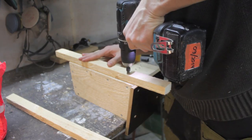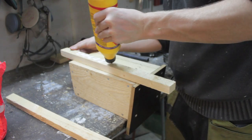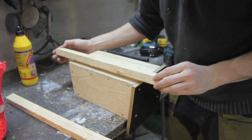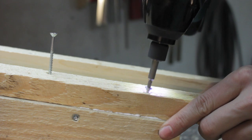Mounting the birdhouse to a frame like I am doing here should be considered optional, but it does allow for better air circulation between the tree trunk and the back of the birdhouse. Once again, the idea is to let the wood dry faster after a rain and avoid structures that will hold moisture.